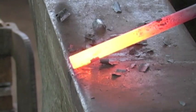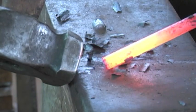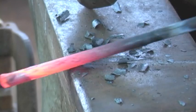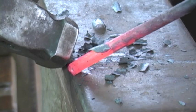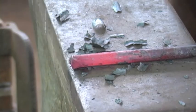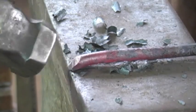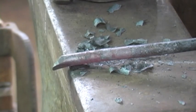Let's see what that looks like in real life. I'm going to hold my bar at about 20 degrees or so, and then double that angle with my hammer, so the bar bisects the angle between the anvil and the hammer. Now I'm going to work on both sides and create a short, blunt taper. Maintaining the hammer angle, I'm going to turn this 90 degrees, drop it down so it's level with the anvil face, and draw the toe of the scarf. Dress the sides. And now I have a three-sided taper.